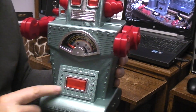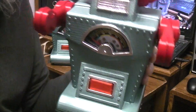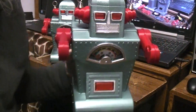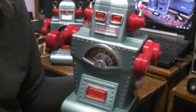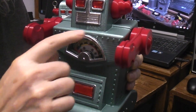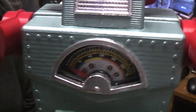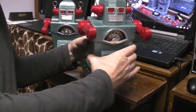For the metal details, I fell back on something that I used to use back in the 1980s — the aluminum foil tape. It's a duct tape for sealing up ducts, and it's a metal foil tape. Because it's such thin aluminum, you can get it to shape and go around things quite nicely. Then you just clean up the excess with an X-Acto knife. It works out quite well.